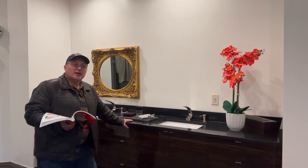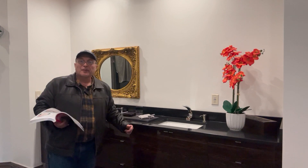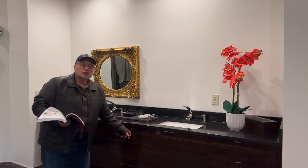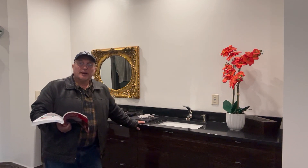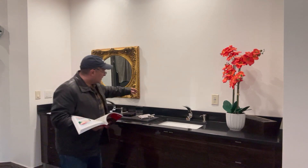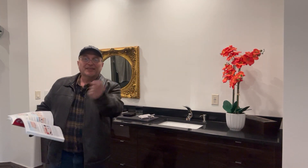It's also really important to find out what's underneath the countertop. We have a drawer over here — if you're going to install the pop-up assembly over a drawer, the drawer in the back may be in the way. You might have to cut the drawer short in the back to accommodate that listed pop-up assembly.